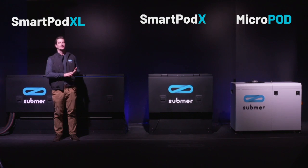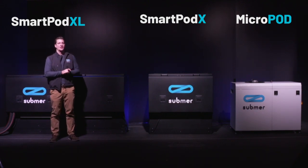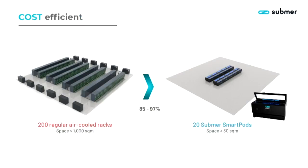We'll open the system and run through it, but these systems in production, together with the secondary cooling that's required, they operate at a PUE of 1.03 — a massive reduction — and we're really looking at getting that PUE right down to one, which is the journey that we're on. They allow us to increase substantially the density per square meter, because the smaller system can host up to 50 kilowatts of IT load, and the bigger system 100 plus. We have configurations and deployments today in the range of 100 kilowatts per tank.